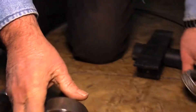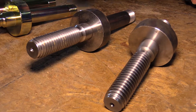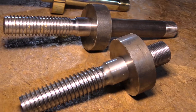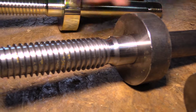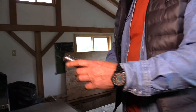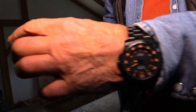All different types of GLs. If you look on the internet, I got all different ones — some that are plated, some that aren't, some that are hardened — and all the different size perches, different size bosses. But the one thing about them is they're all the same from right here on as far as the machining. All the dimensions are the same, so the bits work the same for them and everything — this is all the same.